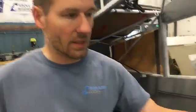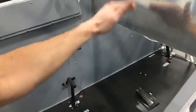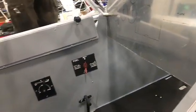One of the things that I'm waiting for is the front stick to be able to make sure we have the clearance under the panel, and that's going to dictate where we end up breaking the panel, i.e. bending the panel back so that the stick will clear, and we want as much real estate as we can get there for all those switches and circuit breakers.